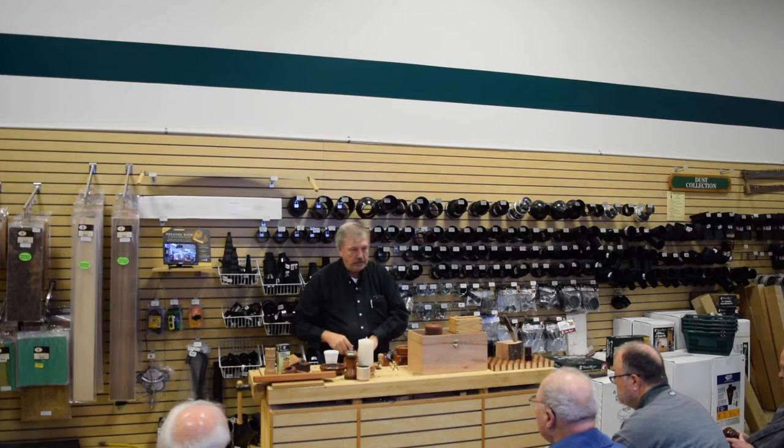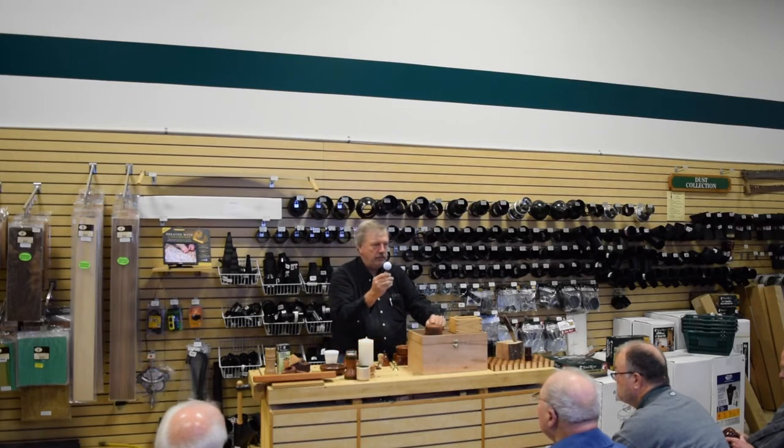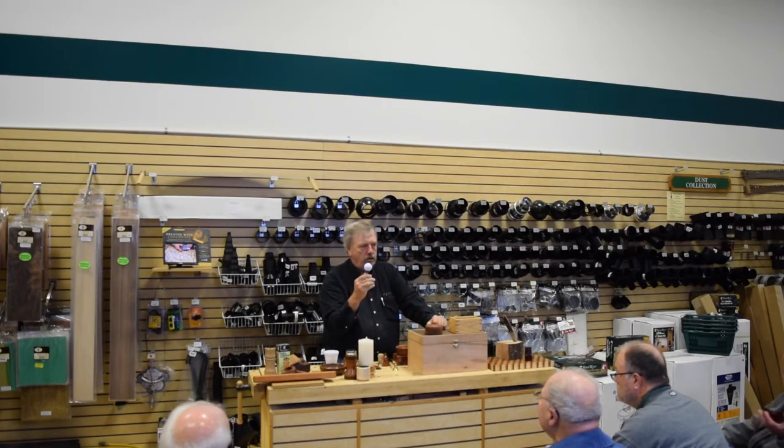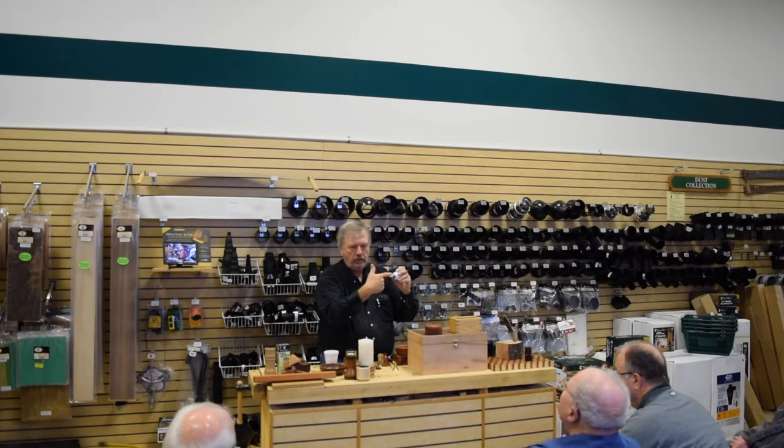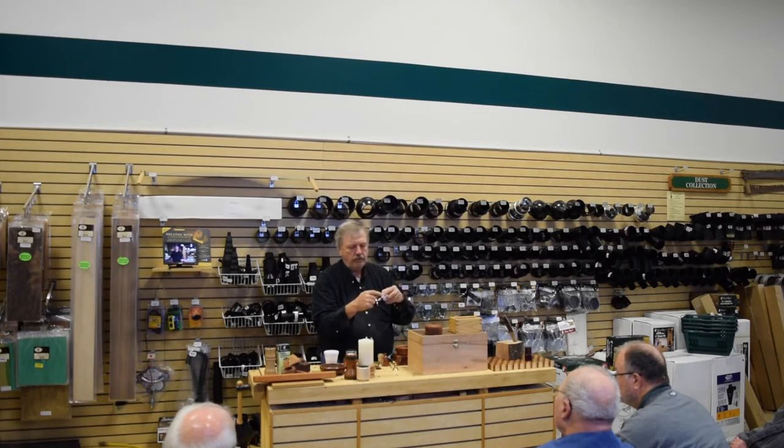If you didn't want to invest all that time and effort, this takes 5 minutes. And all you're doing with this one is holding this in a lathe with a 3/4 inch Forstner bit, until the end of the Forstner bit hits the side, take it off. Drill a hole in here, take this off, little epoxy around that, stick it in there, voila. Golf ball bottle stopper. You give this to a golfer, you think you gave him gold. So this is easy to do.